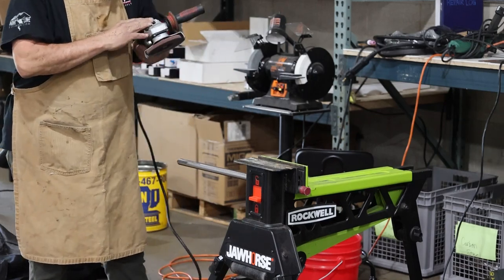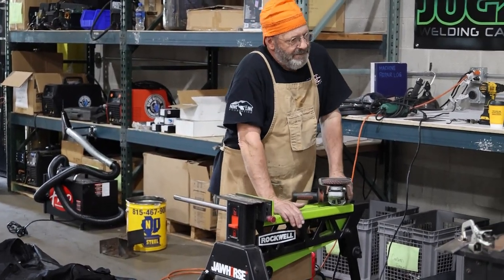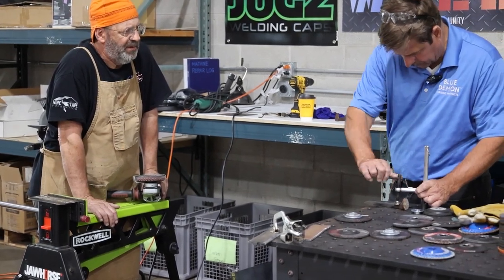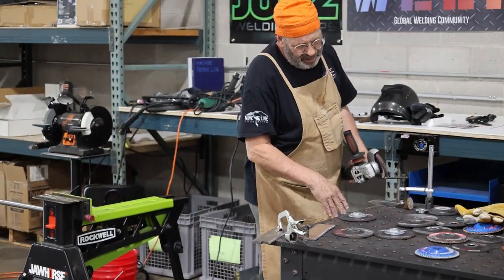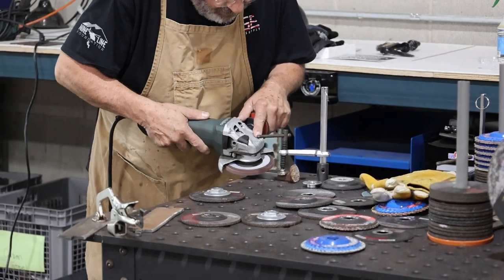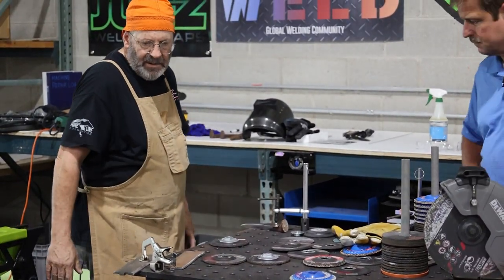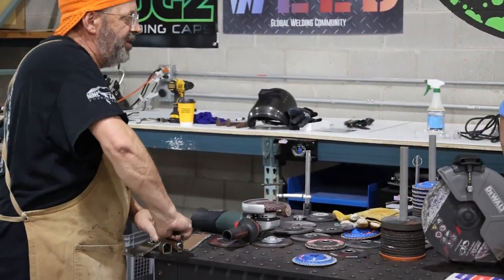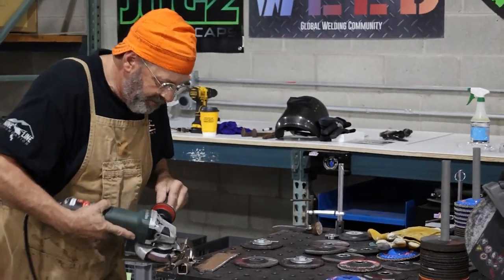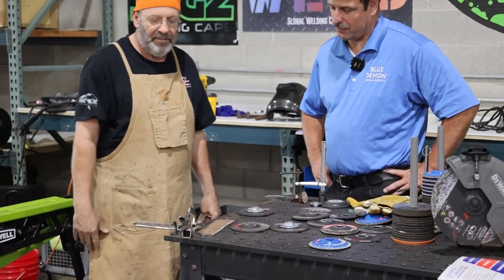What's the grit on this? About 80 grit. Why don't you try it on this piece that still has some patina on it? Just as a finish pass — yeah, you can see the little pits right there. The pits are the deep pock marks. You need scratch to get in there — wow. There are times it may be an incorrect application, but I've found these to be very beneficial in putting a skip-sand finish on metal.